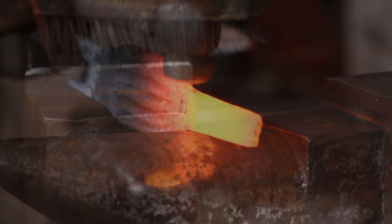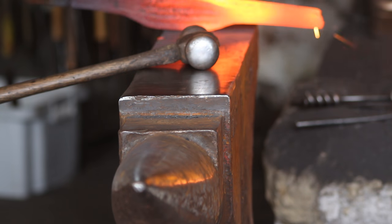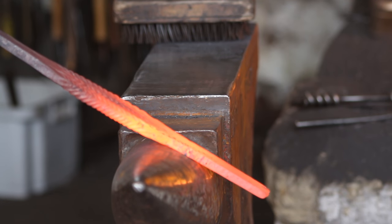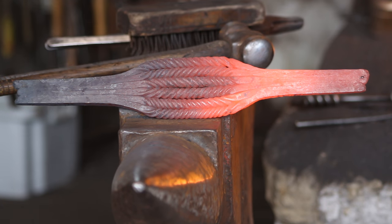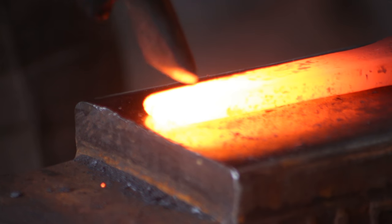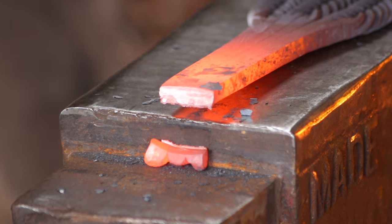It helps that it's wrought iron as well - it moves quite quickly. Just spend some time getting that nice and even. Try and keep the thickness of the original bars at 8mm and just get it nice and even. Then spend a little bit of time just getting them lined up with each other and nice and straight. As you can see some of these weld lines have disappeared already. Don't worry about the ones that are remaining - we will deal with them in the next episode. Before that we're going to take the ugly bit at the end of these tabs and just cut it off.